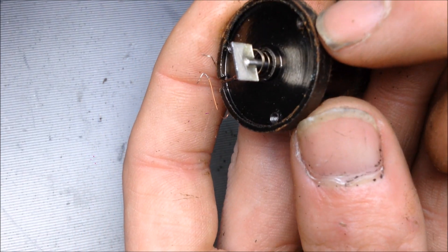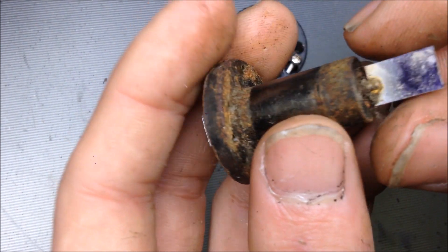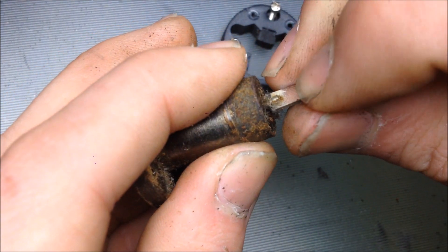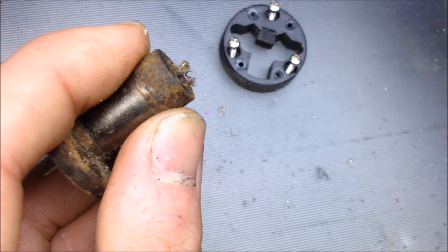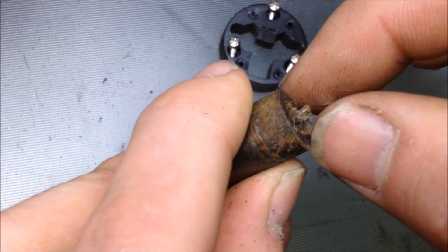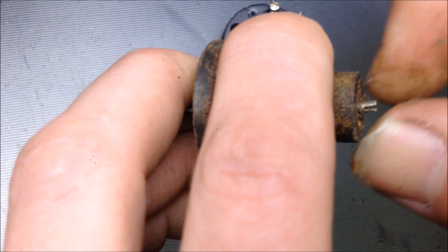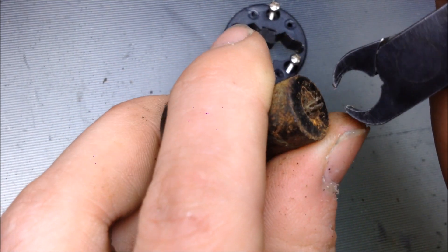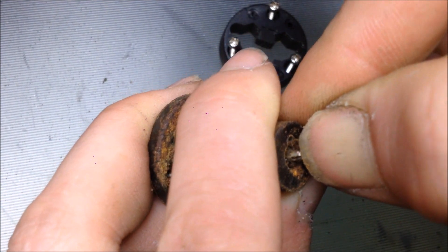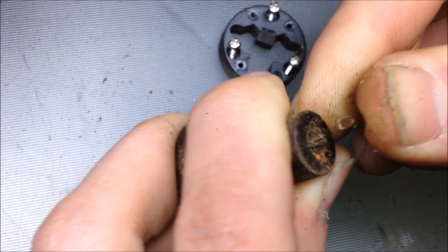You'll see there's a little spring that holds one of the bearings down against the hull of the system. In order to pull this thing apart now, I'm going to have to take off the front mirror as carefully as I can. I'll put that in my box of saved galvo mirrors. Then clean off all of the glue that's remaining, squeeze these together just a little bit, and we can push the assembly down and out. Might be good and seized — oh yeah, that's seized. That's badly seized.